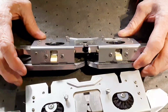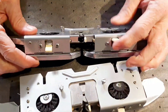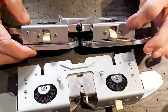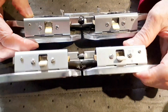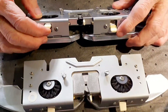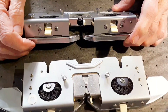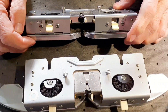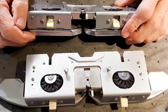This is a 930 and it's got the exact same assemblage. So we're going to do one of these and show you how that spring goes in there, because as best we can discern, all of these Brother sinker plates that have this weaving brush have the same part number for that spring. This is true for many years. If you go back before the 840, it is no longer true — the 800s were significantly different.